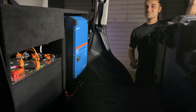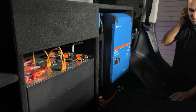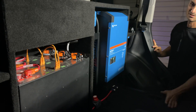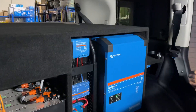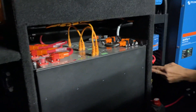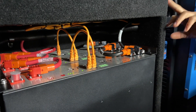We've got everything going on here. We've got the Victron 5000-watt inverter unit, 600 amp hours of lithium batteries — all 48-volt, three of them at 200 amp each. We've got the MPPT smart solar controller, the Cerbo GX — the brains of the unit — that brings all the information back to the screen for the user. Smart battery protect on the 12-volt side, smart shunts where we can read battery isolators, fuses, and the 4G.